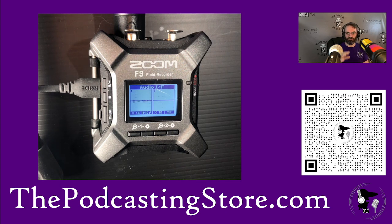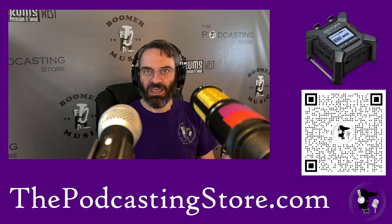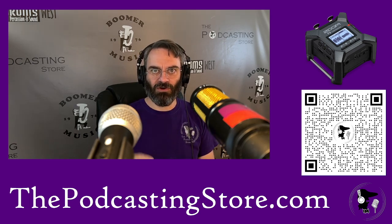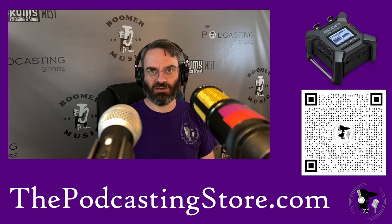You can put a finer point on it and really set the levels, do noise normalization, loudness normalization, and all that. The key point is it solves the problem of an instrument clipping out when you're trying to talk, and you don't have to use two microphones. There will be some post-production, but so what? The other point: you can't alter what isn't there. If I go back to the recording where the Heil clipped out, it never recorded it in the first place — I can't alter that sound. Whereas with what I recorded through the F3 into Audacity, I can add gain, reduce it, compress it, and do all kinds of great stuff because it was actually captured.